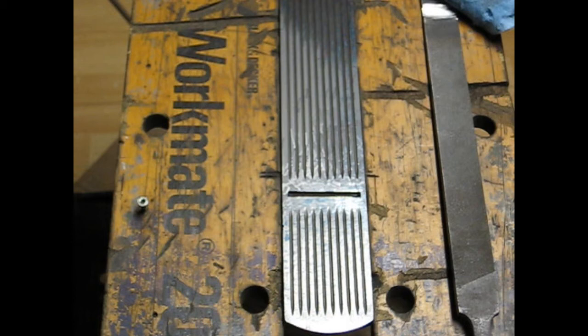A flat granite surface plate, some blue grease, this homemade scraping tool, and the whole thing clamped on my Black and Decker Workmate 200 — it's a really simple process. I'm not wasting any sandpaper at all, none whatsoever, and this scraper I just made for free. So it's up to you. If you guys have any questions, feel free to comment — I'd love to hear your thoughts. We'll see you on the next video, take care.